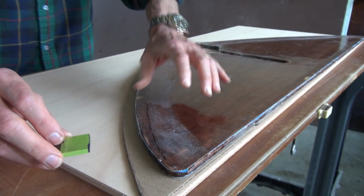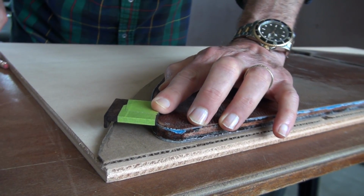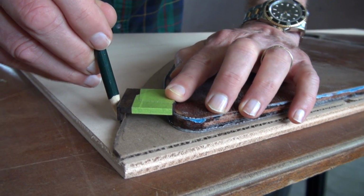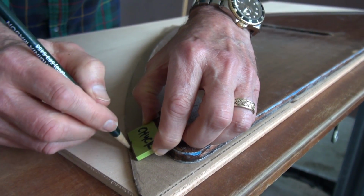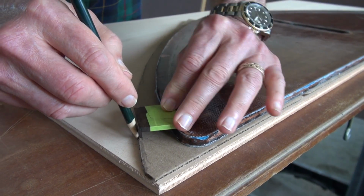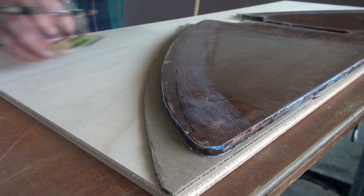and you will take this chip and lay it. This time you'll line up the top edge with the line that you drew. And the L will help you keep your pencil lined up at right angles to the pattern, otherwise if you're doing it other ways it would be tipped down and it would be less accurate. So the little L thing helps you keep the pencil straight. So then you just slide this along the lines and draw it out like that, and then you cut it.